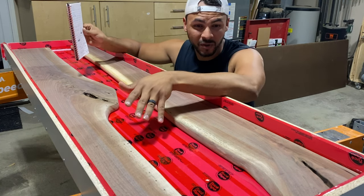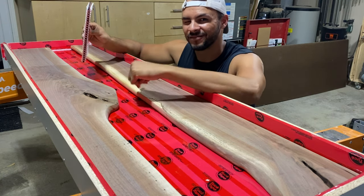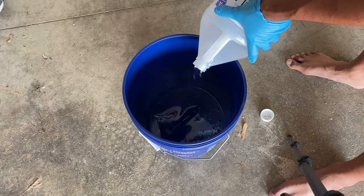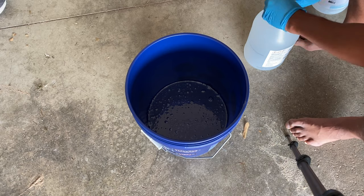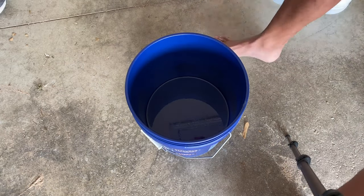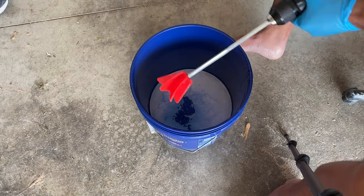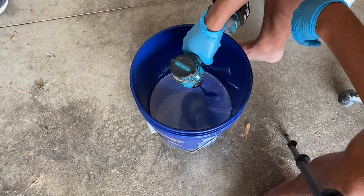I'm not going to pour until tomorrow since we've still got to run the silicone and I want to give it plenty of time to cure. The biggest issues I've read about with epoxy going wrong are not stirring it long enough and not getting the ratios right. So I made sure to pay close attention to my ratios, and I really spent a lot of time mixing — my instructions said at least 5 minutes, but I spent 9 to 10 minutes running the paddle, scraping the sides, scraping the bottom, making sure I mixed all the material thoroughly, then added the pigment.